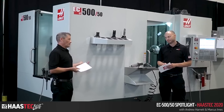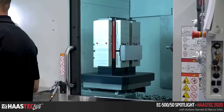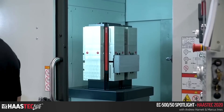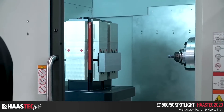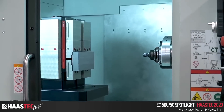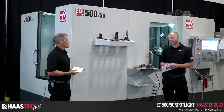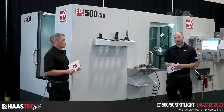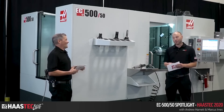With an HMC you can hit all six sides of parts in two setups — that's a big part of why you buy one. The cycloidal drive maintains the accuracy of the earlier worm-gear-style rotaries but is more crash resistant. Nobody likes damaging an expensive fourth or fifth axis, and some can be quite delicate.